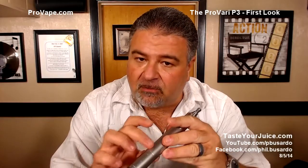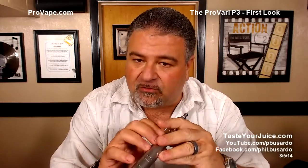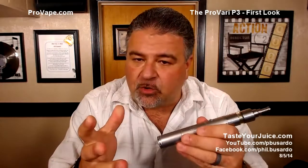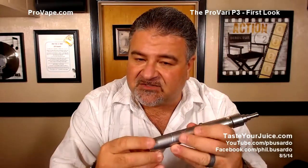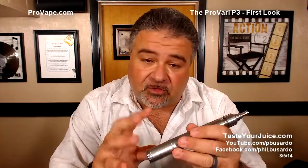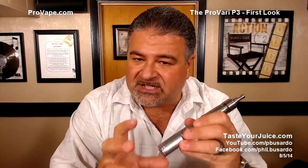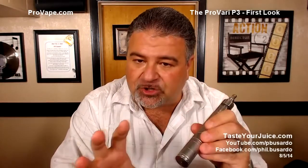It does have thermal monitoring inside, so if the board overheats, it's going to spit an error. We're going to talk about the errors in a little bit. What can you adjust this to? In voltage, you can go from 2.9 volts up to 6 volts. In wattage, you can go from 3 watts up to 20 watts, and it will fire down as low as a 0.7 ohm load. So those are the specs on it.